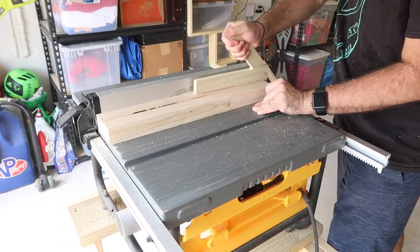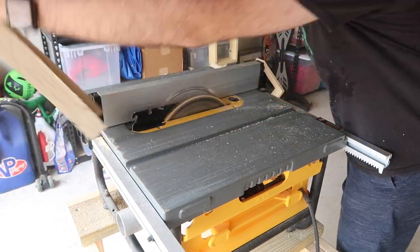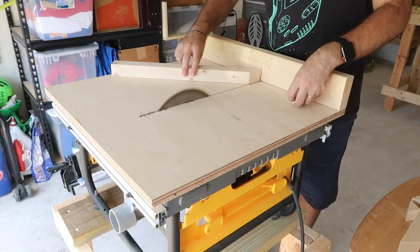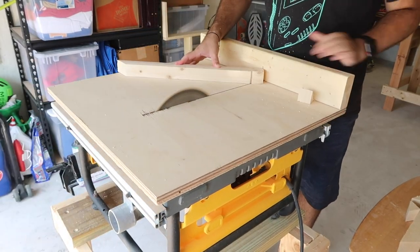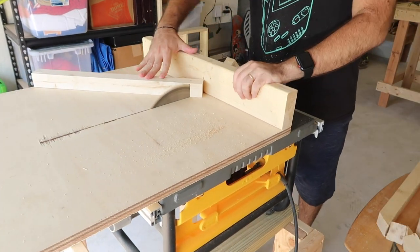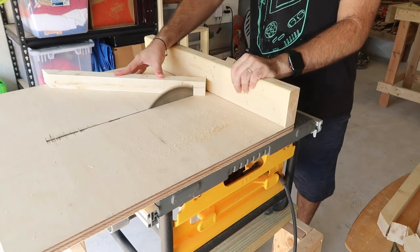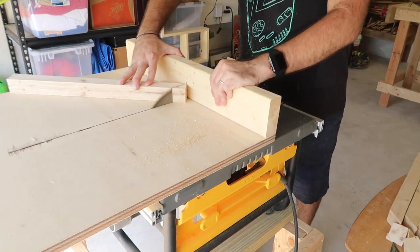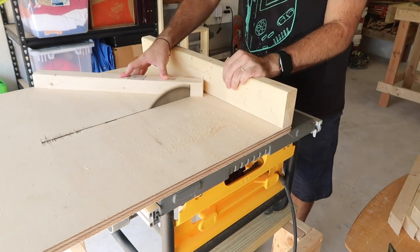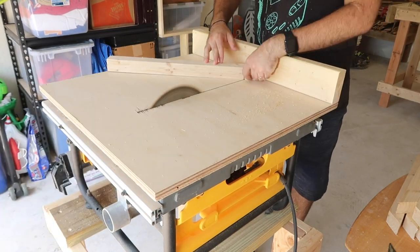As you can see here, I'm just cutting every piece down in the middle to get a 1.5 by 1.5 by 19 inch. Now, the next step is to cut out a 45 degree angle on each side. Now, these have to be matching on these 12 pieces first, because the special 6 pieces, they're gonna have a 45 degree, then you turn it 90 degrees, and then you cut it again on the other end. So I'm gonna show you how to do this later, but basically all these have to be 19 inch, and then your bottom side is gonna be about 60 inches long.